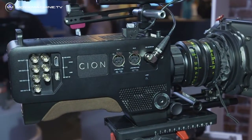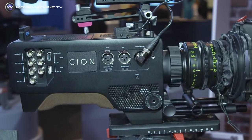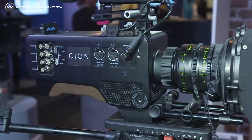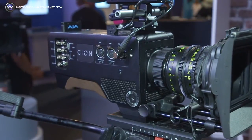Scion is a 12-stops-of-dynamic-range camera. We feature a CMOS global shutter, so that means very stable images under any lighting conditions. Built into the camera itself is an infrared cut and optical low-pass filter as a combined element. These two are key in giving the character of the vibrant image that you see on the screen behind me.